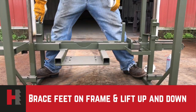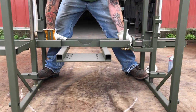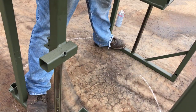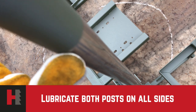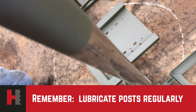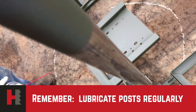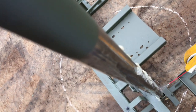After being lubricated, see if you can move it back and forth freely. Make sure that you have sprayed both the upper and lower ends. Regularly, you want to keep your lubricant on the posts. Keep them so they do not become dry, because if they do become dry, you may run into a sticking problem.